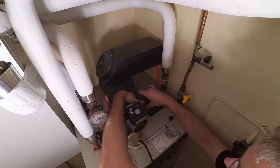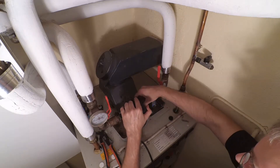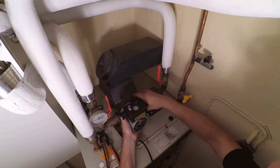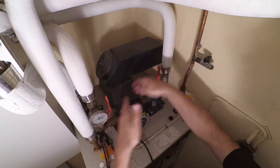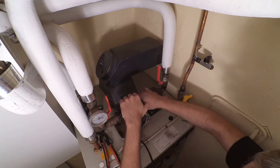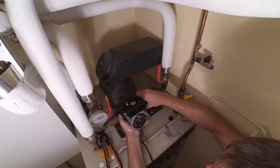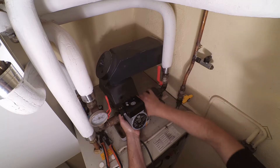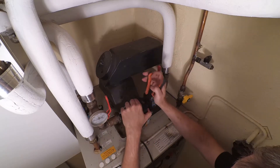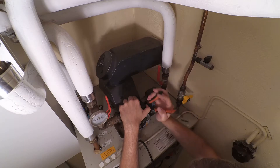Check when you buy a pump that you get new rubber seals, because you do not want to reuse old ones. Also, make sure you buy a pump with the correct size — it measures differently in different countries. In Sweden we have two pump lengths: 130 millimeters and 180. This one is 130, but most pumps come in both lengths, so just check that you get the right one. Always use your hand or fingers to start tightening before you bring out the big tools.